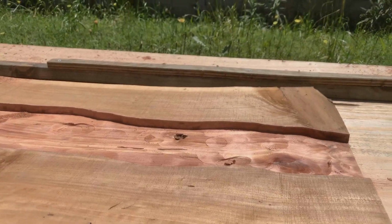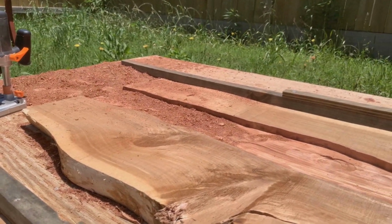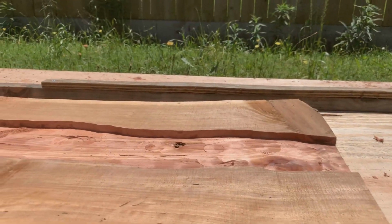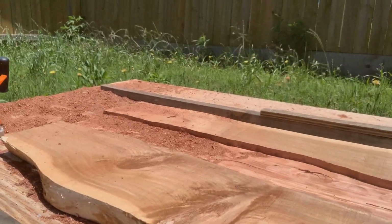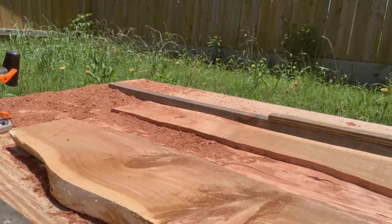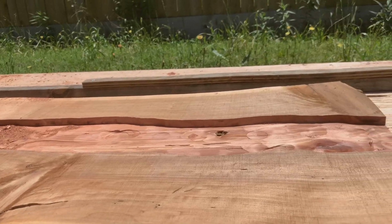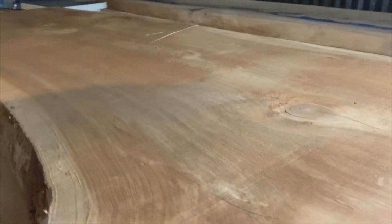All right guys, I think that's about 3/4 inch deep, which should be fine. I went over it 5 times, did about a 1/16 inch to 1/8 inch each pass. Comes off pretty easily once you keep the bit up pretty high, don't go down too low, otherwise it's going to give you a hard time, but it works.